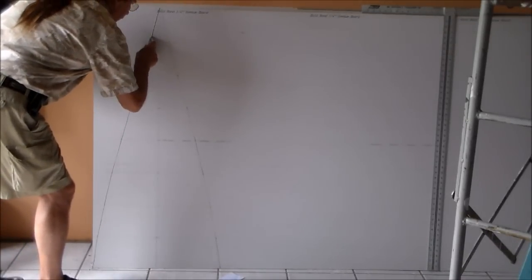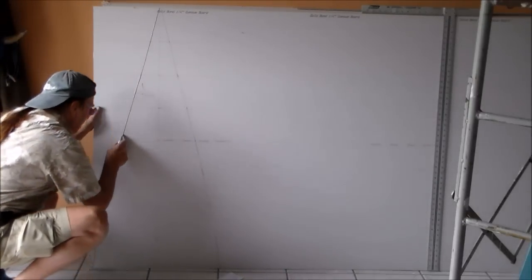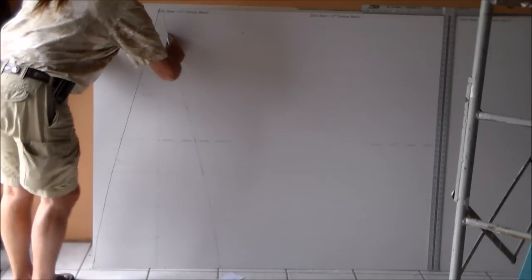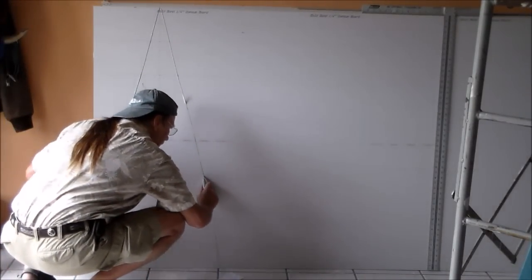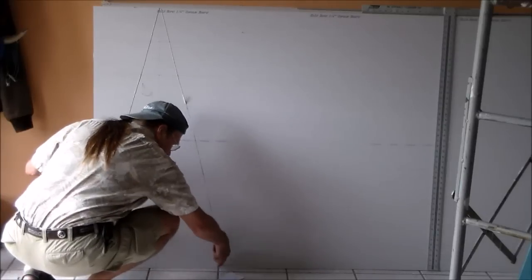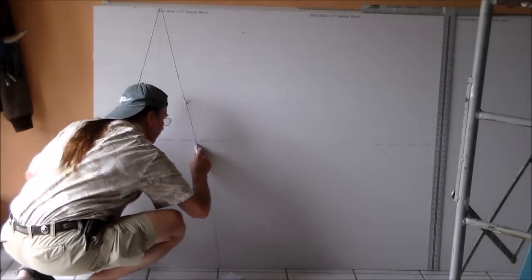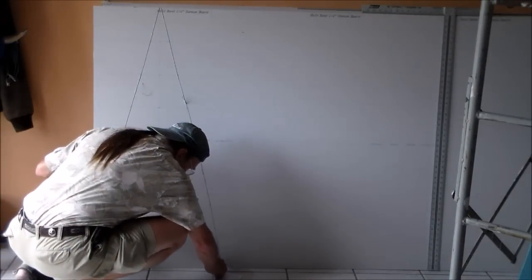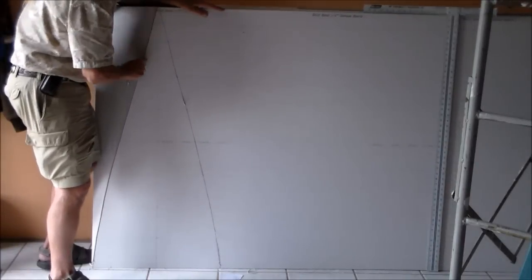This is going to be used as the pattern, and we need to repeat this quite a number of times depending on how thick of a sheet of drywall you're going to be using. I'm using a 1/4-inch sheet, and I'm going to double every one of the pieces that's applied to the dome ceiling, and that will give me a 1/2-inch finished sheet that I'm working with.